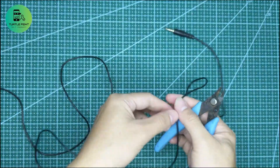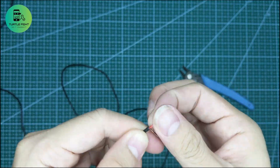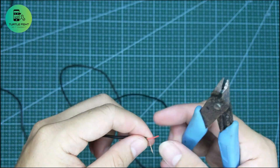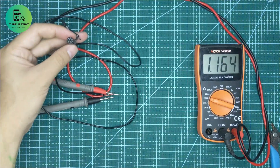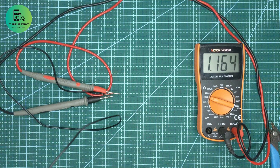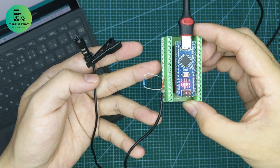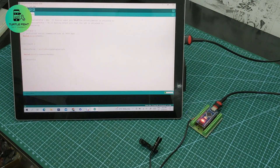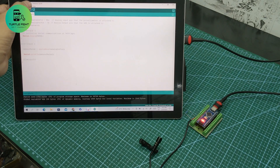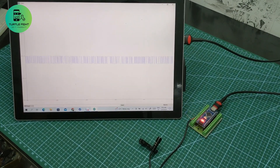With the microphone I'll cut out what's inside. Inside there are two wires: the red wire is the mic pin and the other is ground. I will try it with a resistance meter — every time I make a noise its resistance changes. I have connected the microphone and one resistor according to the diagram to the Arduino Nano to measure the signal. Every time I make a noise there are voltage changes.